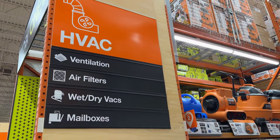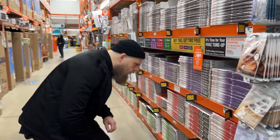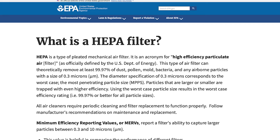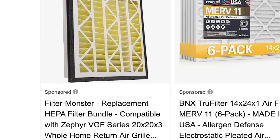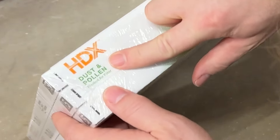And finally, consider the type of material your filter is made out of. Filter material types include fiberglass, cotton, polyester, electrostatic, polypropylene, and others. Fiberglass are the cheapest, but also typically the least effective. Electrostatic filters use static electricity to attract contaminants. Washable filters can be reused, but are typically less efficient than disposable ones. HEPA filters remove 99.97% of all particulate matter from the air, but are more expensive, highly restrictive of airflow, and broadly speaking, unnecessary in the average household. The most common type are pleated cotton and polyester filters, which are affordable and effective in trapping crud in their folds.